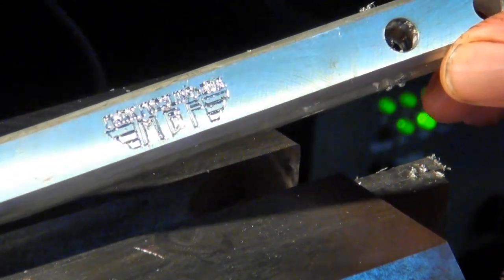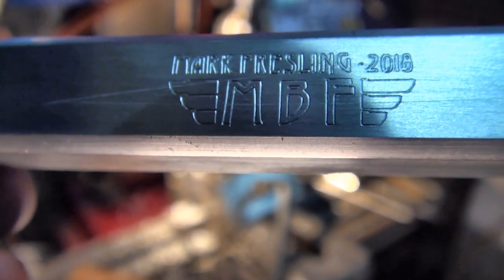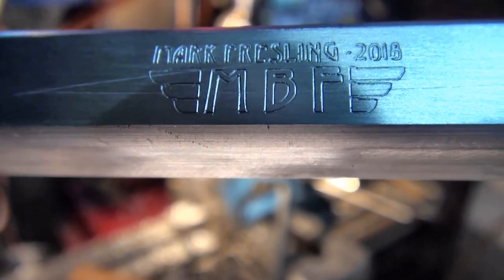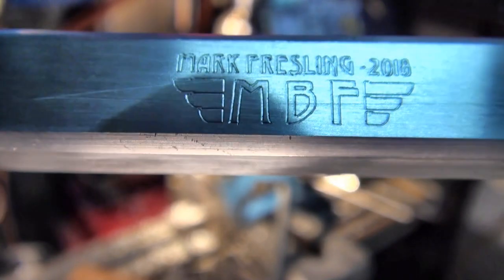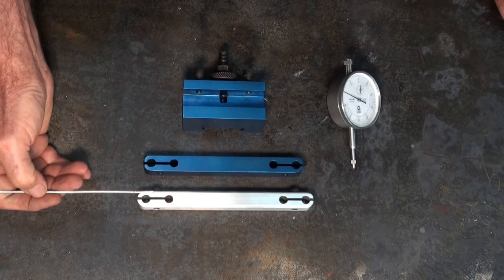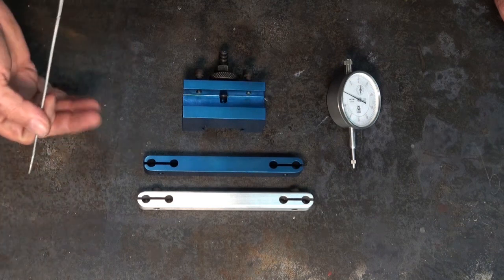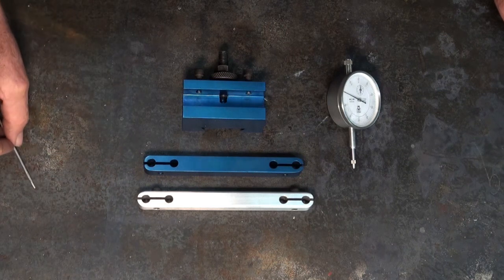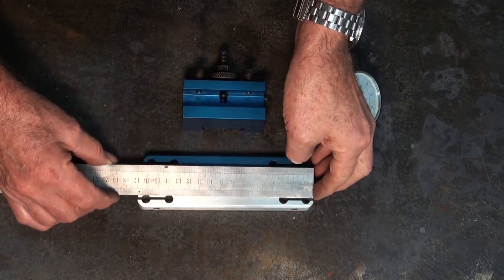I just deburred and cleaned it up. There's a little bit of a mismatch where the various elements start and stop — I think that is actually the backlash in the machine. Here's the new arm. It took about an hour and a half to manufacture this one — it goes a lot quicker when you don't have a camera around and once you understand the workflow. This new arm I cut to be exactly 170mm long from end to end, and the distance between centres on the clamping holes is 155mm.